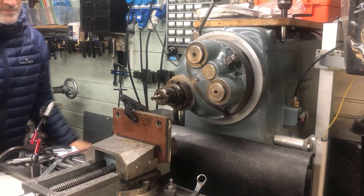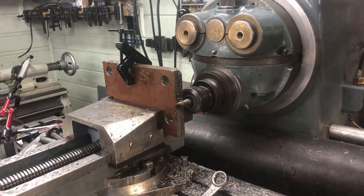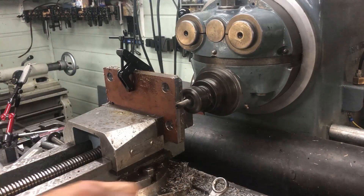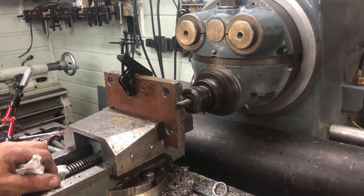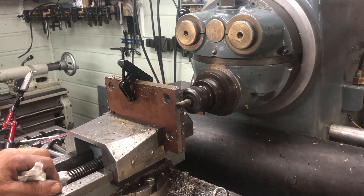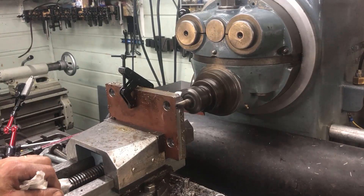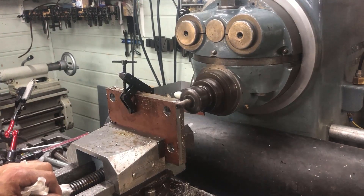So in this case I'm milling the sides and top in the same go. The weight of the machine table allows milling in both directions — both up and down — so you can easily go up on one side and down on the other side. This was a convenient way to use the miller. The clamp on top — I know that's not the way to use that clamp, but it was useful still in that way.